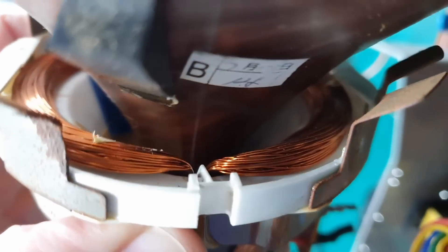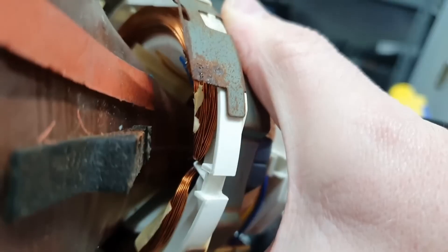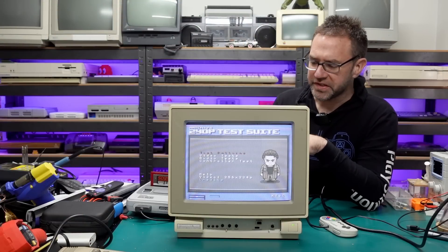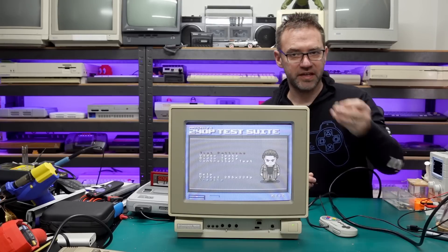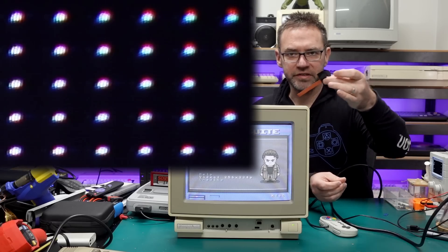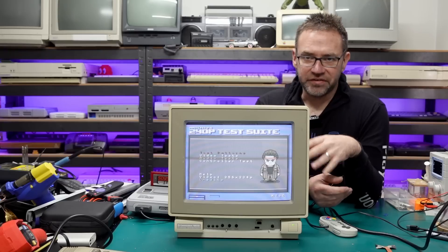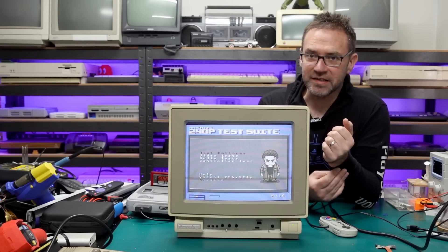While I was in there I also pulled the yoke back to check the yoke windings, because sometimes the glue they use becomes hygroscopic — it absorbs moisture and can eat the enamel coating on the yoke wires, leaving you with either open wires or a shorted yoke. I'm pretty happy the yoke is still in good condition. The convergence strip had also come apart — in fact the end with a tiny magnet inside was just floating around inside the yoke. That's probably why we have poor convergence on the top right corner. I also tried to track down the color issue on the Luma Chroma input — even with a Commodore 64 outputting the one volt Chroma signal, colors are still really low on that input.